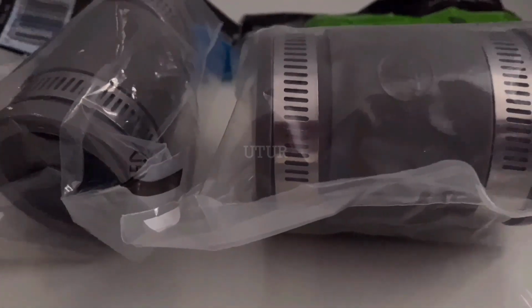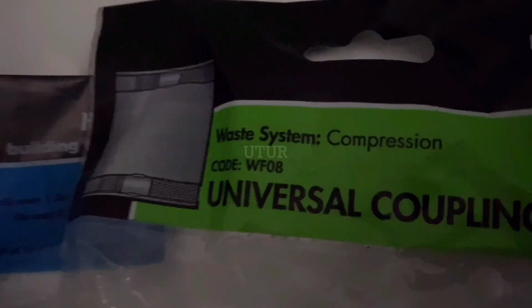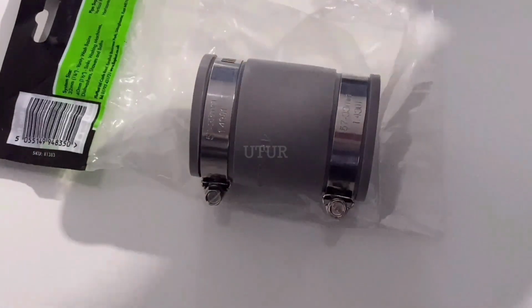Okay. These couplings are universal. They're used in vanity wash basins, sinks, washing machines, vertical pipes and horizontal pipes. So we've just pretty much adapted this to the vacuum adapter for the circular saw, and it works perfectly fine. You might still have some wood dust or chippings escaping, but the majority of the debris emanating from the circular saw is captured. Okay.